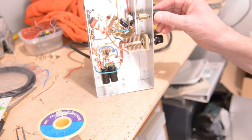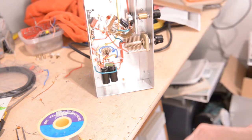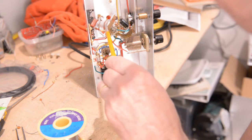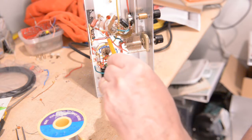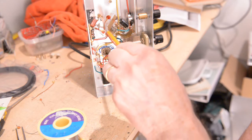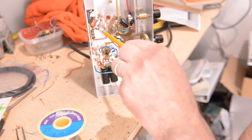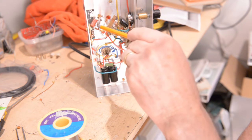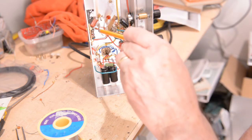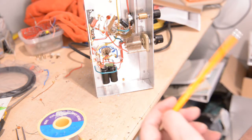That was noticeable also when you turned the VR. You had a response from the tickler, because it's on the same level, as you know. So it's here. If you fire that, that's your tickler. If you connect it on the same point on the anode, it's 0.9. Via that 10k resistor, it is grounded by a 220p and goes via a capacitor to the VR. So that RF came into this VR, and then it goes round and round and round. So you don't want that.